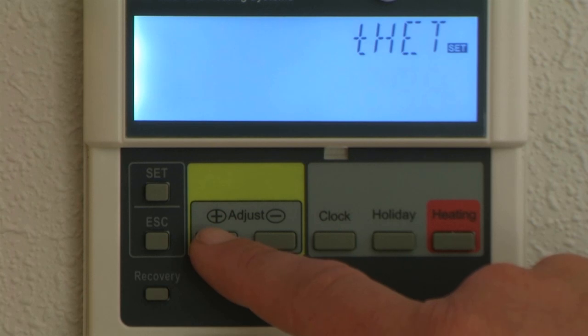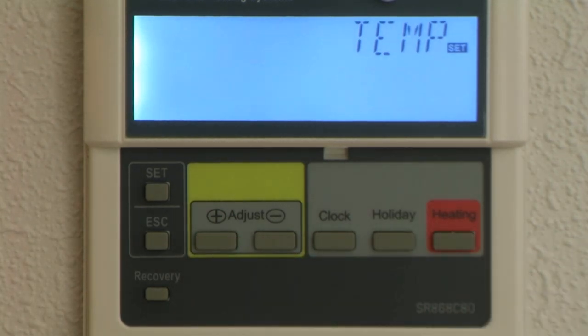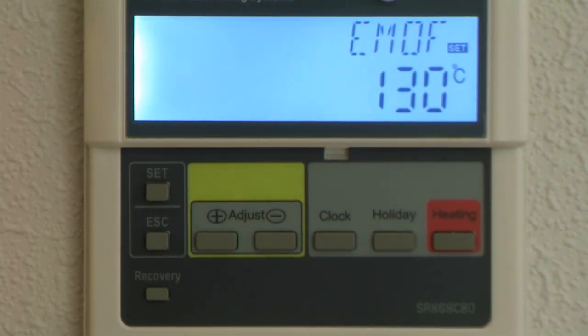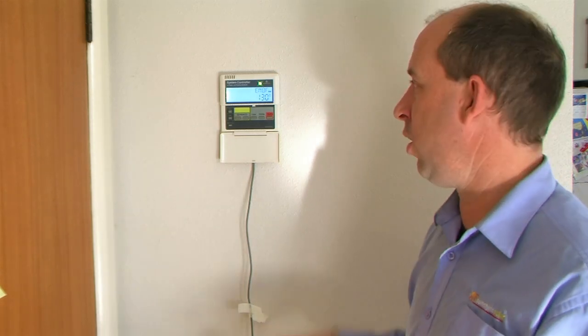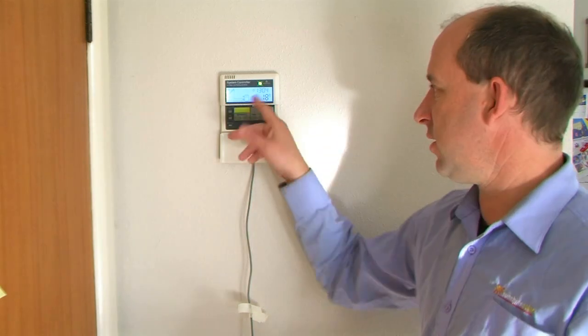We're now up to THET. Coming across the menu tree we get into the temperature menu — this is where most of your safety protections are. Press the set button to get into the protection systems in the controller. EMOF, if you have a look at your manual, is the collector maximum switch-off temperature. If the collector gets higher than this temperature then we won't put any more water back into the system, because we're trying to protect the valves and the fittings and prevent leaks in your system.